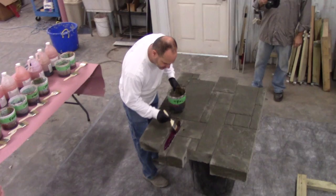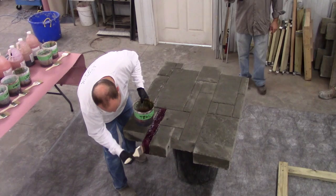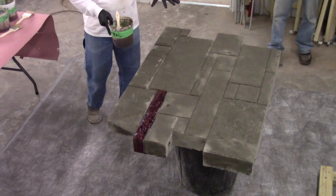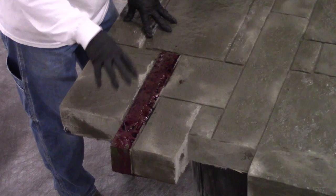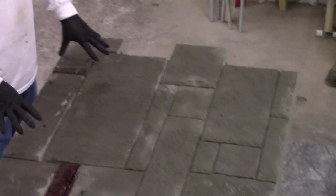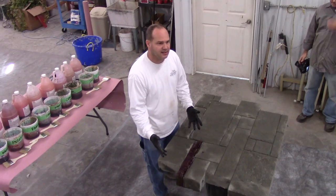I just take a chip brush and tag the surface of the rock with water just to dampen it a little bit. You don't want standing water, but you do want it lightly tagged — it helps the stain. I'm liberal, I put down quite a bit, and just tag the outside edge. I just stained that teal. When it's done oxidizing, it'll mottle completely and naturally, and I won't have to do anything else. You can see pits and valleys where some stain is grouped together — that's perfect. It means more intense color in those areas.